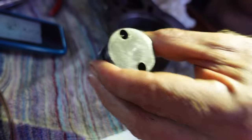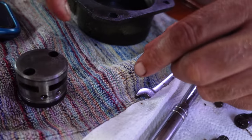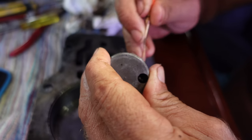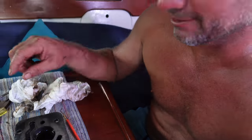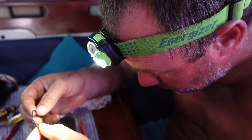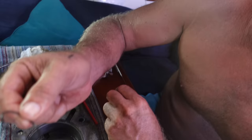Got the little ball out — had no idea that was there. That ball and the three grooves are how you feel the selector click click click into forward, neutral, and reverse. There's a bolt on the side which releases the spring pressure on that ball — that's how I'll reassemble it. The O-ring has seen better days. It's hard to say without glasses, but it would only need the slightest wear and it won't seal. That's what we need to hunt down.